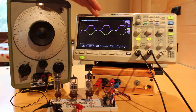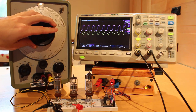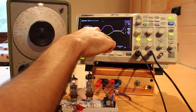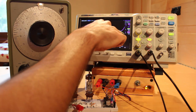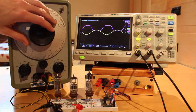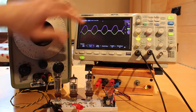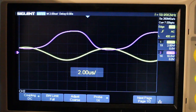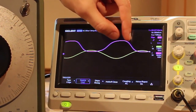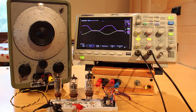At 10 kilohertz — no big deal at all. Let's go faster. At 30 kilohertz, something really interesting appears: when we're in saturation and transitioning from a low output to a high output, this is taking noticeably longer than the transition from high to low. At 60 kilohertz, the rise time is still taking a considerable amount of time, which means the amount of time we're spending in full cutoff — the high output — is getting shorter and shorter.